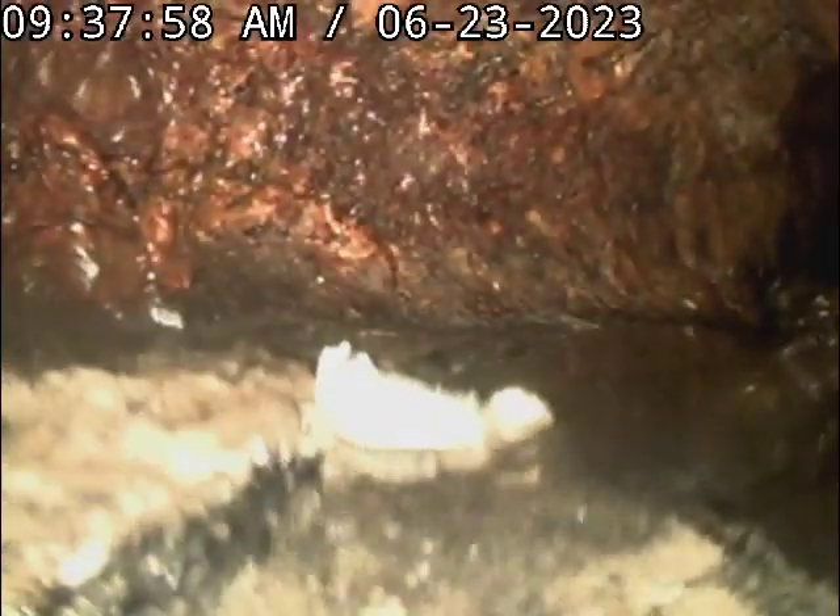The water just sits and swirls, and we can push right back to where we were. So the sewage and everything goes, but then it's gotta go uphill. Picture your drain like a water slide — it should just leave. But this is going uphill here, so the cast iron is rotted out, broken on the bottom, and it stops all the solids from actually being able to leave the house.